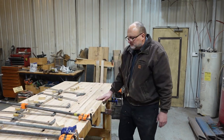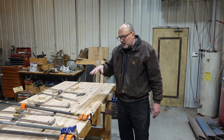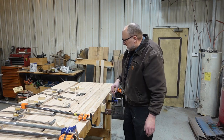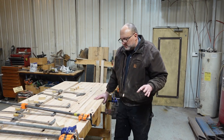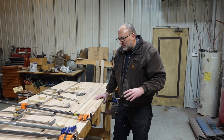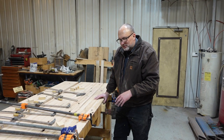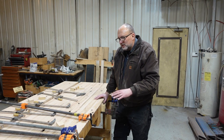I've got everything flattened out and I'm satisfied. I just did a little light sanding off camera, not too much because the epoxy is going to demand more sanding after that's done. I've got two things I need to do with the epoxy. One, I need to fill in these major voids — they're huge holes that need to be filled to get everything nice and level. I'm going to use a tabletop epoxy for that. The holes are not super thick, like one-inch diameter at most, so I don't have to worry about temperature issues. They just need to be filled to make a solid top.